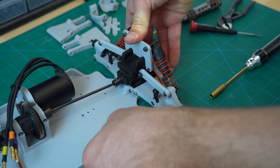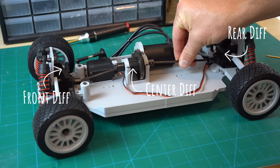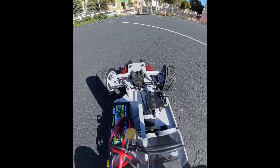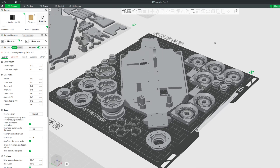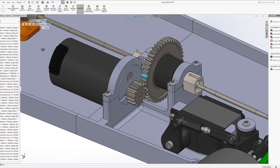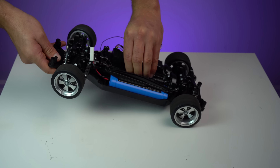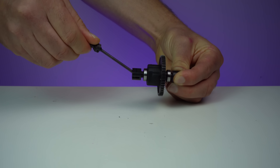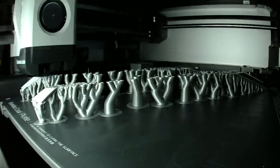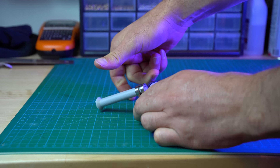Let's talk about why I'm designing a new drivetrain. Right now, this chassis transmits power from the motor to the wheels using metal gears and driveshafts. These components, along with the differentials, were carryover from an existing RC car. I want as much of this car to be 3D printable as possible so I can share it with you folks. Almost every RC car I've seen uses a driveshaft to transmit power. Shafts have one weakness when it comes to 3D printing — prints are grown from a build plate layer by layer, creating parts that are inherently weak along those layer lines, which makes a 3D printed driveshaft a really bad idea.